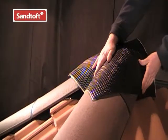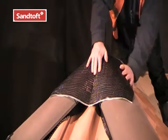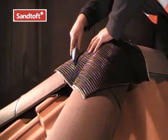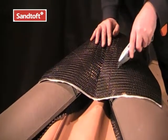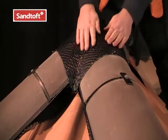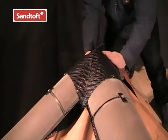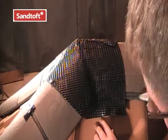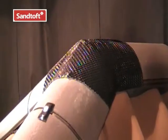It will need cutting from a 450mm wide roll. Put the saddle over the junction and dress it roughly over before removing the backing paper. Once it is in position, we will trim it from the bottom of the intersection, around here, keeping the edges parallel with the hip tile ends. Then we are ready to remove the first backing paper and position the saddle over the junction. Then we can peel the other backing paper off and finish dressing the saddle. Any excess can be simply trimmed off with a sharp knife. And there we have a neat, simple way of covering and weathering the hip ridge junction.